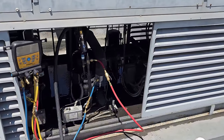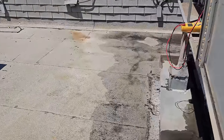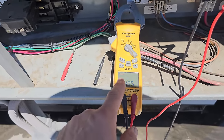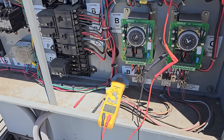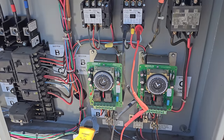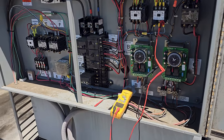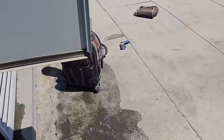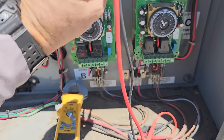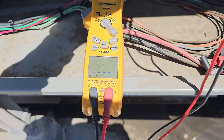It's been running and it should be reset. Coming back over to it now — yes, it's reset. But I'm not going to stop. We're going to let it run for about another five minutes to make sure the compressor stays cool, then we'll try to restart it and see where the problem lies. I suspect it's just hot, and it had a slightly dirty condenser, but we'll see once we start it up.